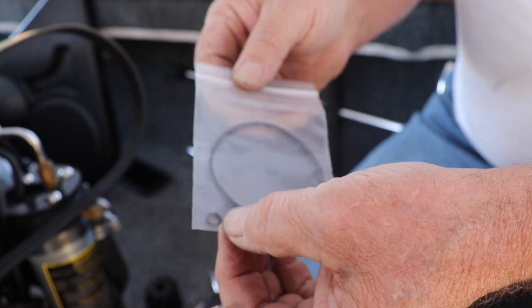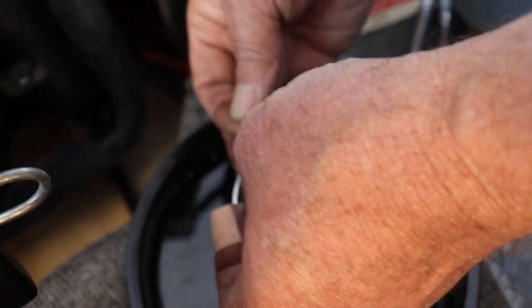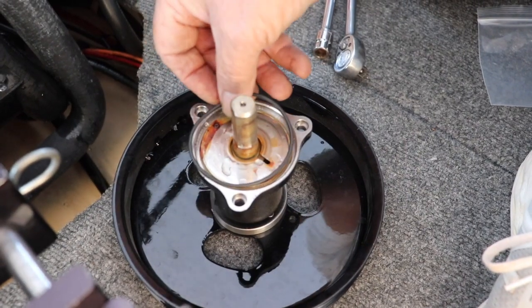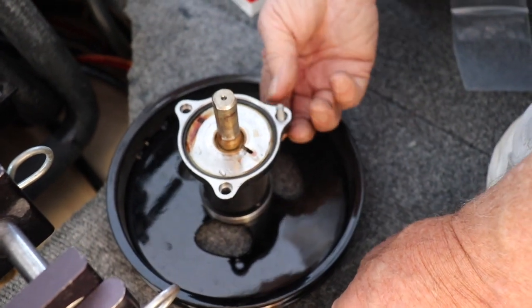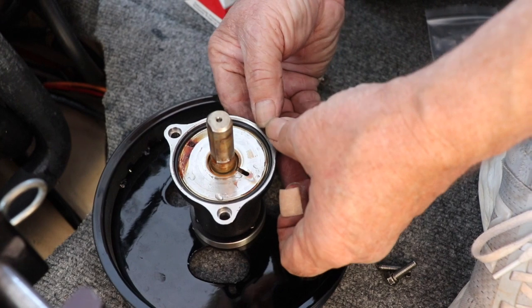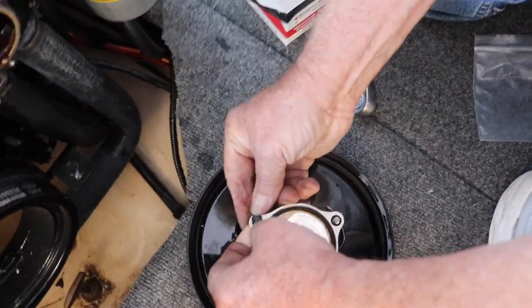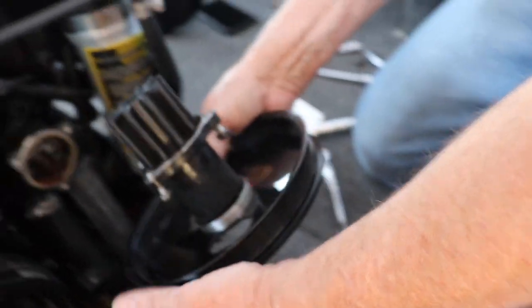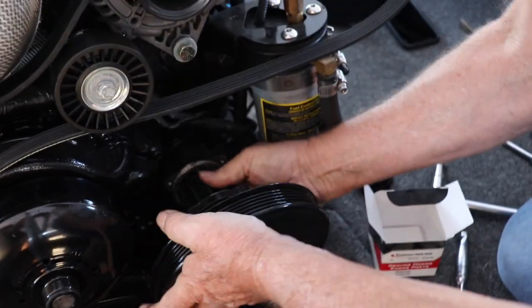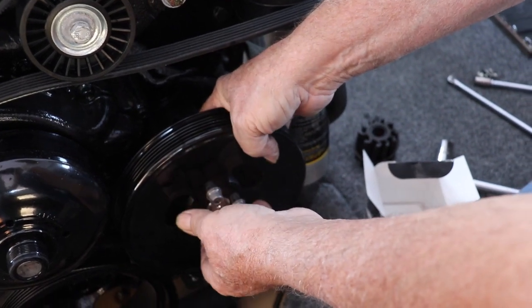This is the little packet with the big O-ring and the three little O-rings for the bolts. We'll go ahead and put those on, slide the impeller back on the shaft, and put it back onto the main housing. You can push up on the bolts, grab the little O-rings and they just slide off. Put the new O-ring into position, then take the new O-rings for the bolts — just slide the bolt through the hole, push the O-ring on and the bolt will stay in place and won't fall out. Once the O-ring and bolt O-rings are in place, we're ready to put the pump back on. You can bend the impeller any way you need to to get it in, adjust once it's in, and you don't have to worry about which way the bolts go. Line up the word 'top' and tighten the bolts up.